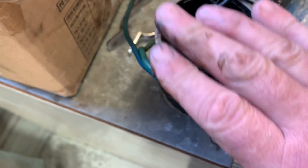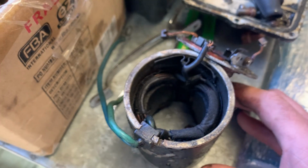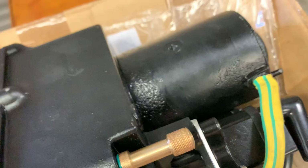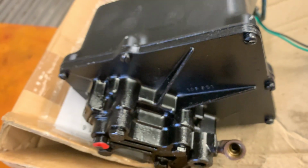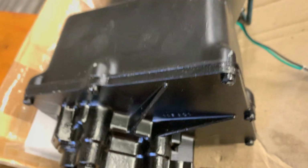So that was the one that came off my good pump that was working when I pulled it out. But the other pole shoes were better, still wrapped in, looked in pretty good nick. So I nicked that body and put it on here. Put the new brushes in, greased up the bushes, cleaned everything thoroughly because it was a disgrace, and rebuilt the pump as best I could with second-hand parts.